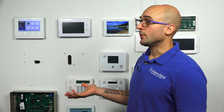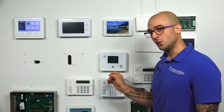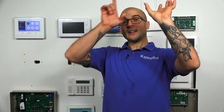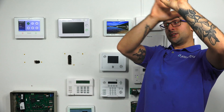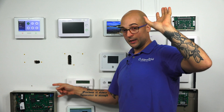One of the most popular ways to do this is to purchase keypads that have receivers and transmitters built into them. One of the most popular keypads is the 6160RF. It looks just like this one right here, except it has a built-in 5800 transmitter in it. This allows you to use 5800 devices with the system — wireless security devices like a wireless door contact, window contact, or smoke detector. The device sends its signal out, it hits that keypad with the radio inside of it, and it goes into the panel.